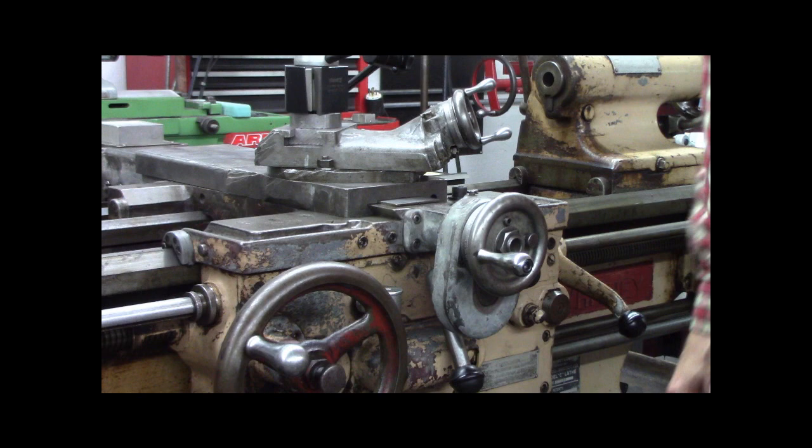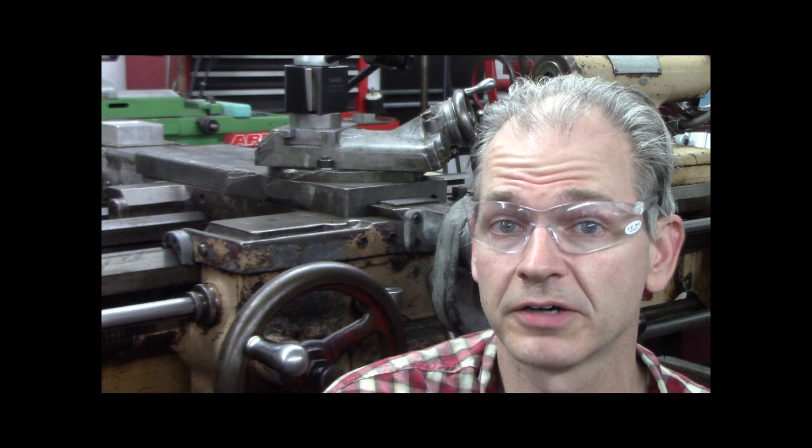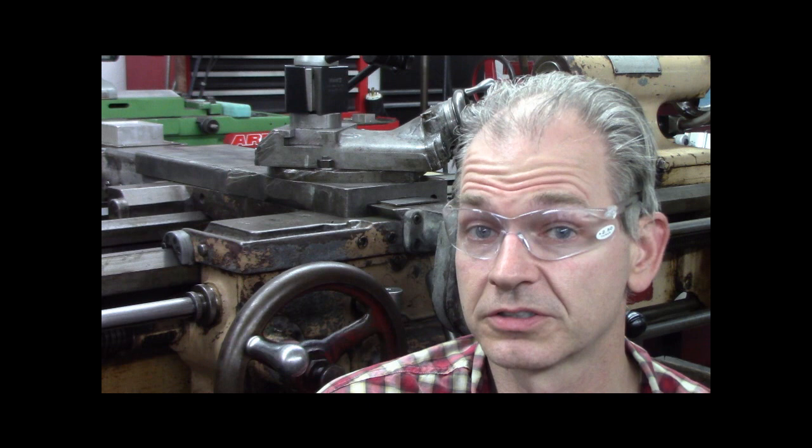Thanks for watching me take this Pratt & Whitney Model 12C, take this lathe apart and clean it, and do a little bit of diagnosis with the dial indicators. So basically, I went from about 5/1000ths of springiness by just me pulling on it to about 2/1000ths of spring, and I have isolated that 2/1000ths completely, exclusively to the half nut, which I need to adjust a little bit because it's a split half nut for backlash compensation. So I think maybe I'm gonna play with it a little more, but I'm pretty happy with that.